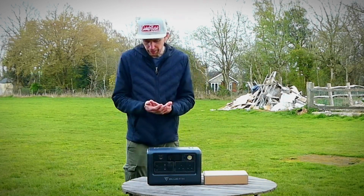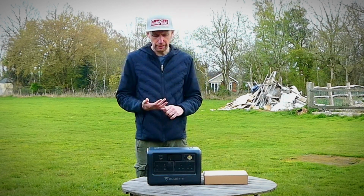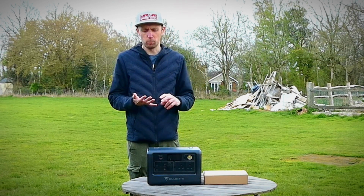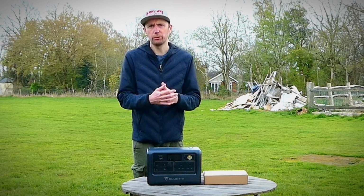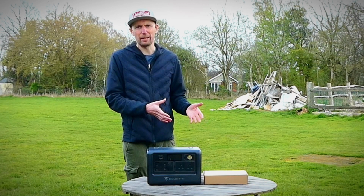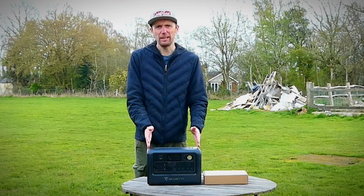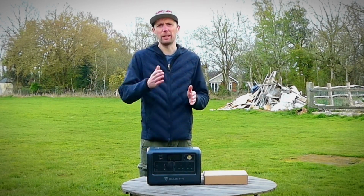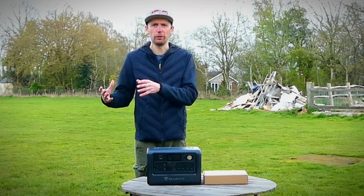So, right, getting down to the Bluetti itself. This one is the EB70. It gives out 1,000 watts, so it'll take up to 1,000 watts and gives 716 watt hours. Watt hours is sort of the length the battery's going to last. For example, if I had my electric blanket on at 120 watts, 716 watt hours will give me, let's say, 8 hours. But 1,000 watt hours is possibly going to stretch me to maybe 10, 11 hours. That's a rough guess. That's not an exact science.